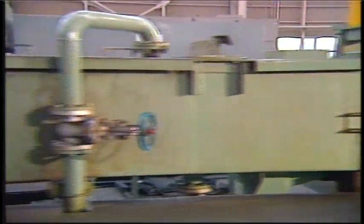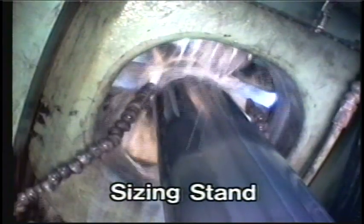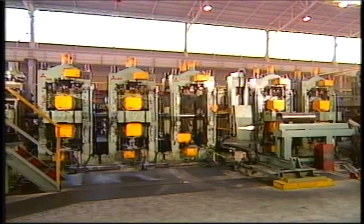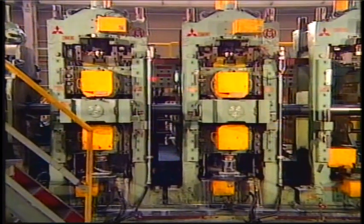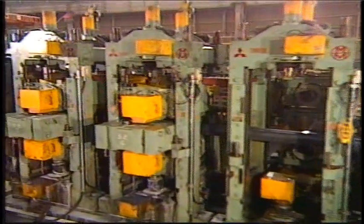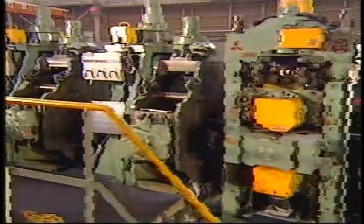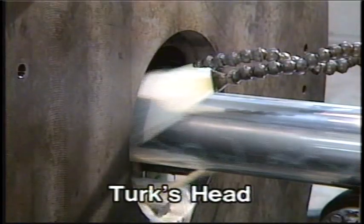Trim tubes are cooled uniformly in the cooling zone. They are then finished to the final dimensions at the four roll design sizing stands. Round tubes are finished on four stands, while square and rectangular tubes are first processed to perfect roundness on two sizing stands before being processed to their final shapes on the remaining three stands. On the exit side of the sizing stand, two Turks heads are installed. The two Turks heads enable tubes of exact dimensions to be obtained by precise adjustment in three axes: X, Y, and the rotation axis.